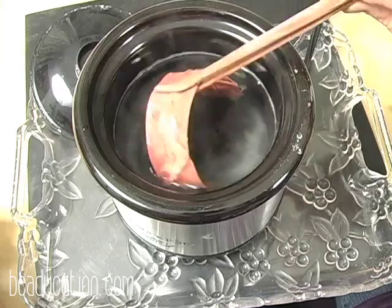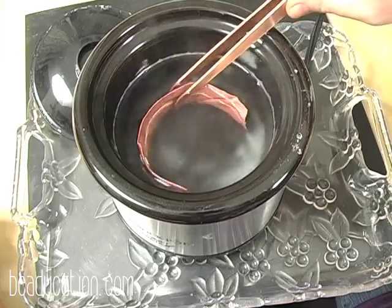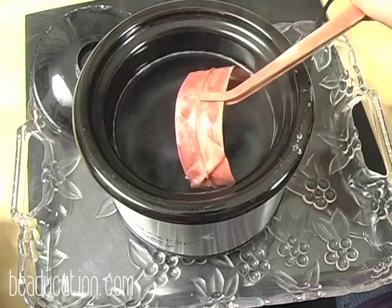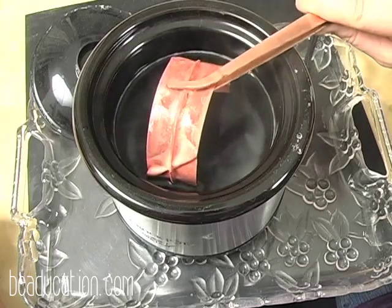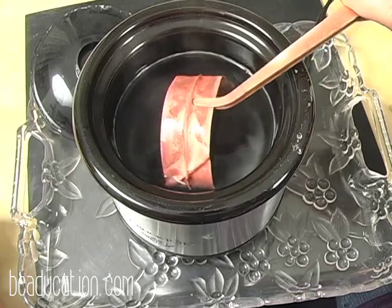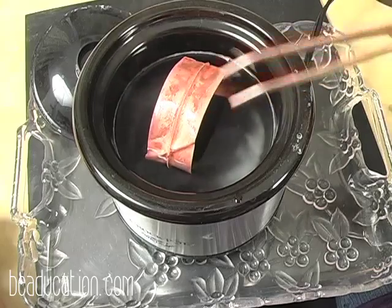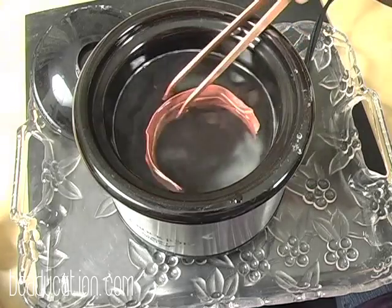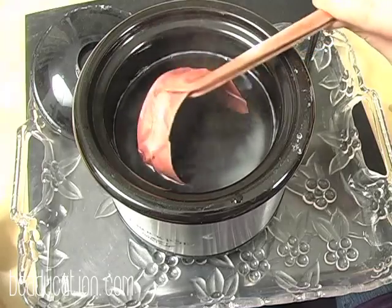It's going to come out and you'll notice that it looks pink now. It doesn't really look like nice shiny copper anymore, and I call this the shrimp skin look, because this to me looks like boiled shrimp when it floats to the top of your pot and it's ready to be eaten, and it's got this nice satiny pink look. That's what I look for to make sure that my copper is nice and clean, is that shrimp skin look.